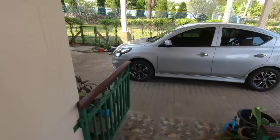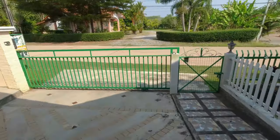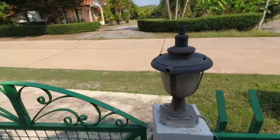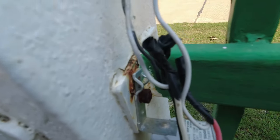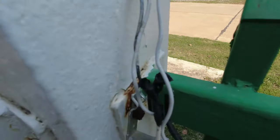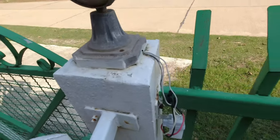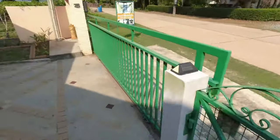The other electrical things I'm going to do are really just tidying up — things that shouldn't be allowed. We've got some wall lights where the cables are just joined together and taped up. This isn't waterproof, so it could become live under fault conditions. I'm going to tidy those cables up and put them in a proper box so it's all waterproof.